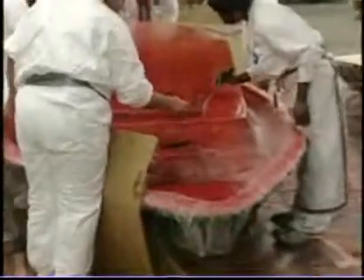The gel coat was the first layer we put on and it's only eggshell thickness. So this glass has to reinforce it up tight against it, or that eggshell finish will crack.